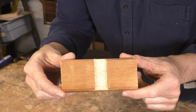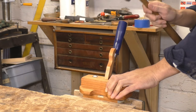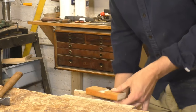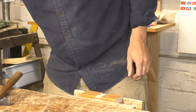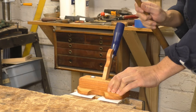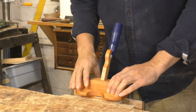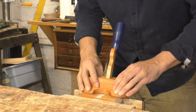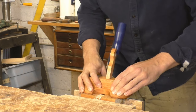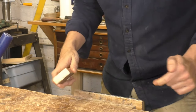Now that the plane is finished, let's learn how to set it accurately. I've made another test dado. If I just want to smooth out the bottom, it's easy enough to tap the iron until you can feel it just taking a light cut. Then you can work your way in from one side, cleaning and leveling the bottom as you go. To avoid blowout on the far side, flip the piece in the vise and finish the last bit from the opposite direction. If you want to make your dado deeper by just a bit, you can get a really accurate depth setting by taking a piece of heavy paper like a note card and cutting it in half. Put a piece of paper under each side of the plane and then tap the iron down until it's just barely touching the surface of the wood. Then take out your paper spacers and start cutting. With thick paper this is about the heaviest cut the tool can take, so I angle it a bit to skew the iron, making the cut easier and leaving a cleaner surface. When I'm done, the joint has a flat and even bottom with very crisp edges — I can slide in a shelf or another component and this joint is going to work perfectly.